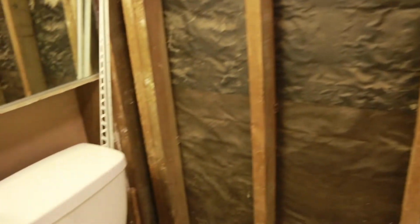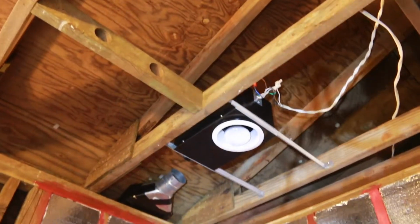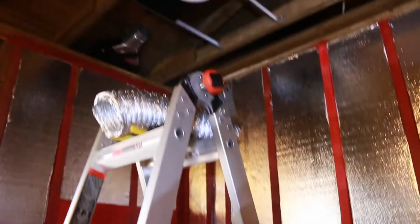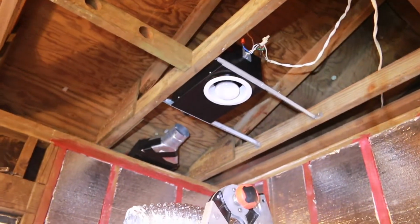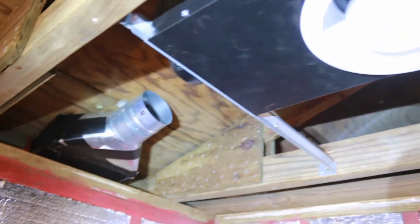Another important thing to remember when you're putting in a shower, where you're trying to keep the moisture out of the bathroom to prevent mold, is to get a fan in. There's no fan in the ceiling in this bathroom, so that's also good for airflow when you've got other reasons for needing a fan. I tore out the ceiling in this bathroom, and the drywall is 40 years old. It wasn't bad, but I needed to get a ceiling fan in here. I've got all this work done in the shower to try to mitigate mold. It's kind of pointless if I don't have a ceiling fan. So I've got it set up here so you can see. It's like an AeroPure, good quality fan, really quiet.